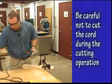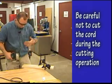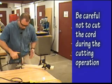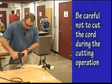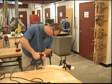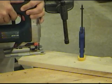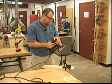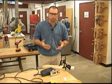The last thing to consider is the cord — you don't want to cut the cord; that'd be shocking. Plan your cuts: just like on the bandsaw or scroll saw, you can only twist so much. You can also control vibration by keeping two hands on the saw and keeping the base flat on the wood at all times. Let's go ahead and make a cut. Follow through, hold it out until it stops, then set it down. This is important with the jigsaw because you can bend the blade if you pull it out too quickly.